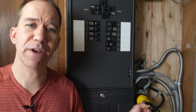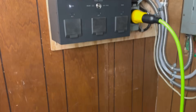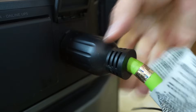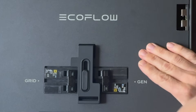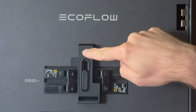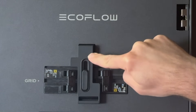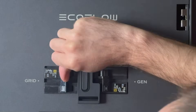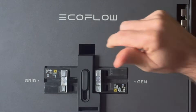If the battery runs out completely and you still don't have grid power, you have the option of a generator input — either a gas generator or another battery that can output 240 volts. For this generator test, I'm actually going to use the Delta Pro Ultra as my generator, using its L14-30 standard 240-volt port. With a sub panel like this, you're not allowed to back feed power to the grid, so there's an interlock on the front that forces you to disconnect from the grid before you can turn on the generator breaker. We'll turn off the grid, push this down, and turn on the generator.